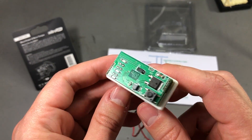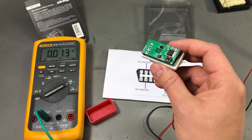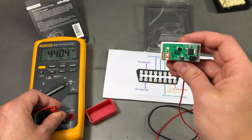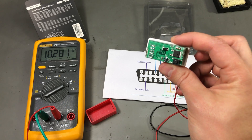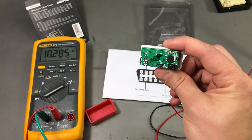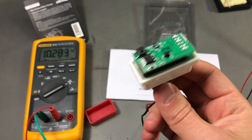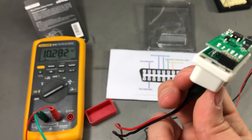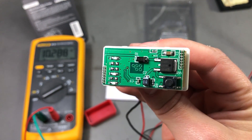I've checked with an oscilloscope. So I'm curious as to what current this thing will be pulling, because if the current is high enough it might drain a car battery over a longer time period. At start it's 44mA because all 3 LEDs are on, but then when it goes into that standby mode where it only blinks the red LED, it's around 10mA with a few short spikes when the red LED turns on. 10mA is not too bad — it would take 290 days to drain a 70Ah battery at 10mA, but of course you're going to start the car within that period so the battery will get recharged.